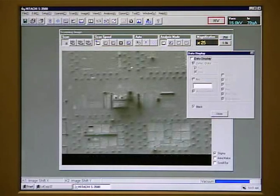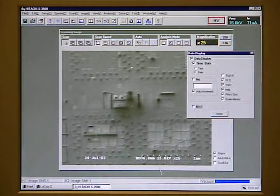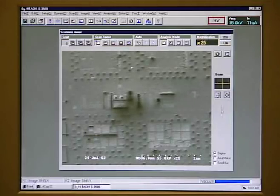If the data display option is not selected, the data display will be off. We can deselect the black bar to get white letters superimposed on the image. These boxes will show the working distance, the accelerating voltage, the magnification, the photo size, and the scale marker. As you can see, the working distance is 36 millimeters. On the stage, the working distance should be 30 millimeters, so this value should be adjusted to match the value of the stage. We cannot get perfect alignment, but the value should be close to the Z setting on the stage.